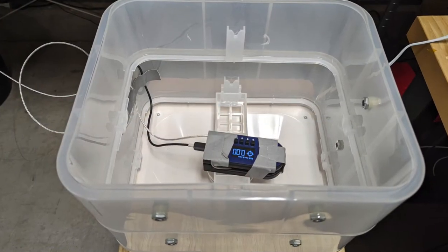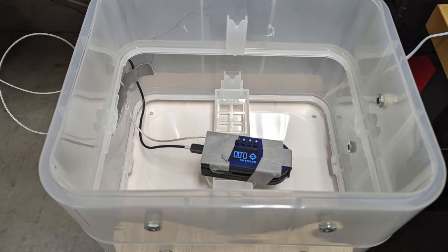Lacking a fancy environmental test chamber, I decided to devise a simple and repeatable thermal cycle test routine. This allowed me to test various sensor settings and target densities across a similar range of environmental conditions. The process I developed used a freezer to cool the device down to below zero degrees Celsius, then used a 3D printer filament dryer to subsequently heat the device up to above 45 degrees Celsius. Putting these two together and normalizing the data across all runs, I was able to collect a lot of information on the device's thermal performance.